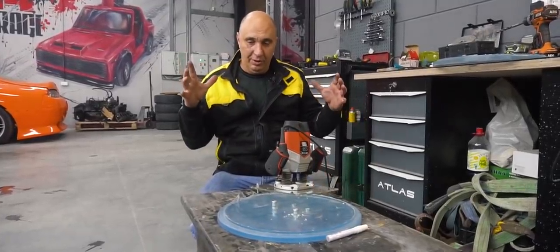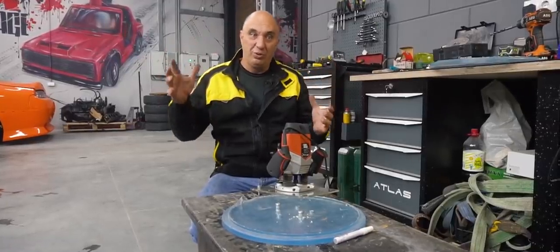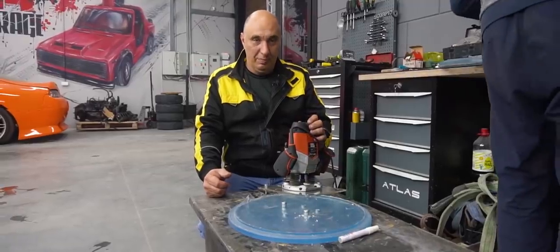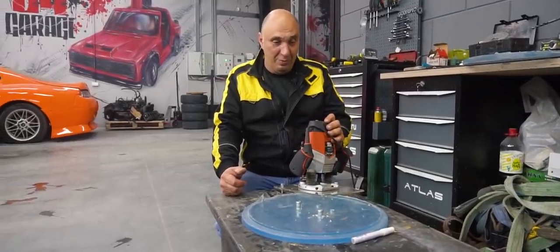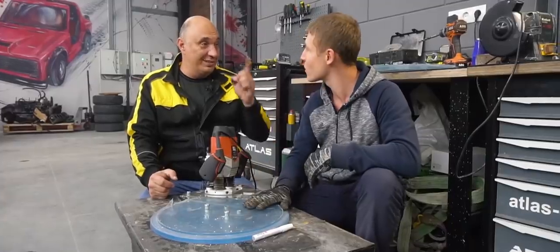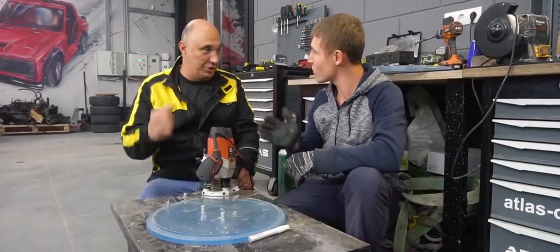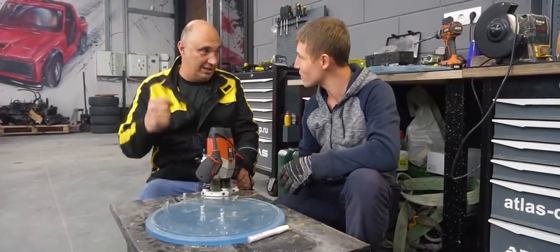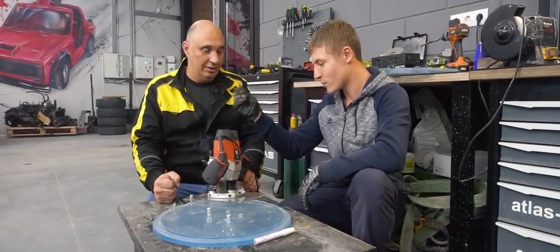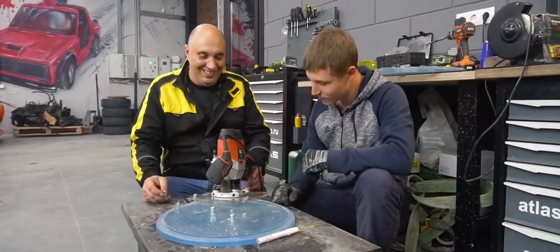Given its diameter, it's gonna start doing a sort of figure eight. So as a result, we need to fix the issue on this CNC machined piece by hand. Didn't I tell you we should have put that in the diagram? Though this is my screw-up as much as it is anybody else's, that we didn't specify the tolerances. Okay, so 3/10 and that's it. Then we measure it, and if it's more than that, we bring it to them and demand that they redo it. Sure. Okay, time to fix this mess.